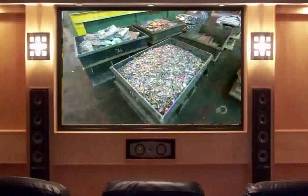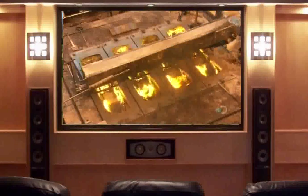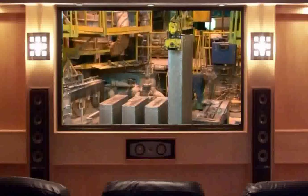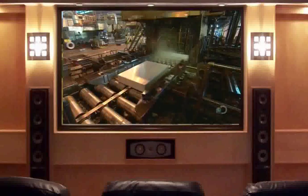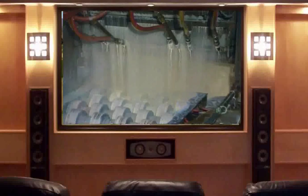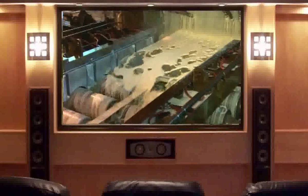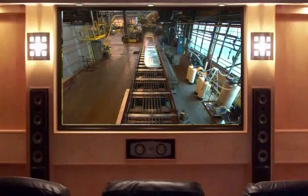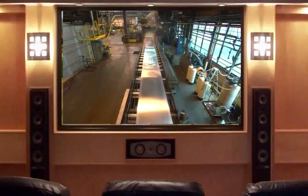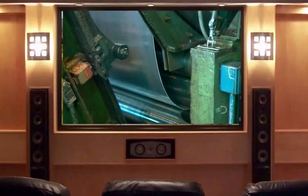To make the aluminum pan, they use 70% raw material and 30% leftovers from prior production of pots and pans. They fire it to a molten state and filter it to remove contaminants. The liquid aluminum flows into vertical rectangular molds, where a jacket of water cools it from liquid to solid. A crane extracts the cast slabs, heading to a heating chamber to soften them for shaping. A saw slices the slabs in two and trims the ends, and blades scrape the top and bottom to remove impurities. A conveyor repeatedly feeds the shorter slabs to heated rollers, compressing the aluminum to about half a centimeter thick and elongating it from 2 meters to well over 100 meters. Pizza cutter-style blades trim the edges, and another roller winds the aluminum into a big coil.